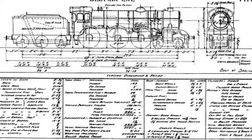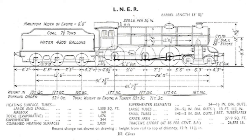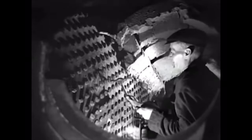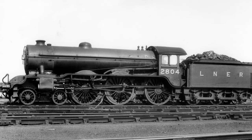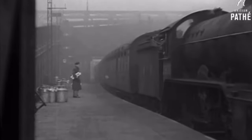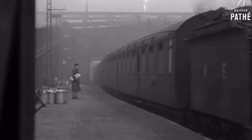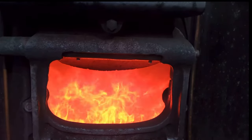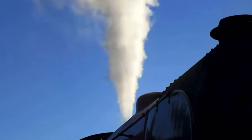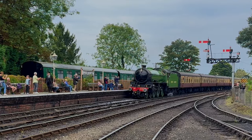This led to a design that utilised existing patterns, jigs and tools to save on materials and labour, with extensive use of welding instead of steel castings. The boiler was adapted from the Diagram 100A type fitted to the LNER Class B17 Sandringham 4-6-0s, but featured a larger grate area and increased boiler pressure to 225 lb per square inch.